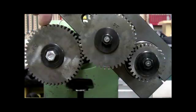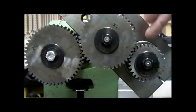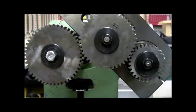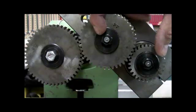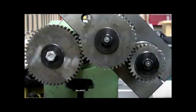Had the fraction been negative, we would add another idler, making the rotation go clockwise, counterclockwise, clockwise, counterclockwise — driver and driven in opposite rotation, causing the hole plate to turn opposite to the index crank. Sometimes a fraction like 12 to 7 won't scale well — for example, a 4 to 1 ratio: the smallest gear is 24-tooth, but 4 times 24 would be 96, which we don't have. In that case, we compound the gear train: two fractions of 2 over 1 times 2 over 1, with a second gear stacked on top. That would be a compound gear train, whereas what we have here is a simple gear train — one driver, one driven.